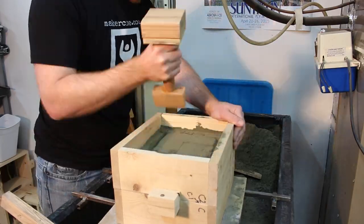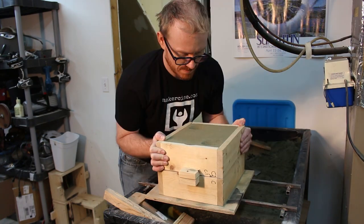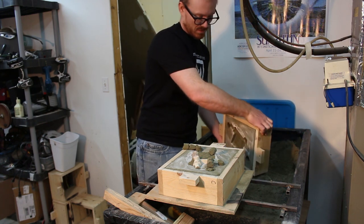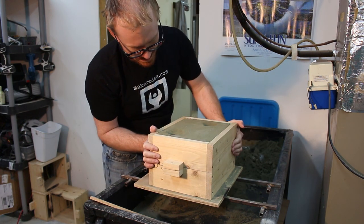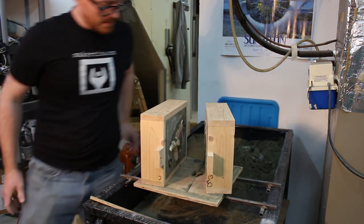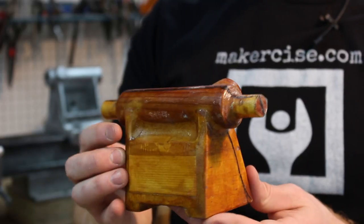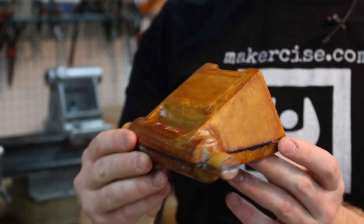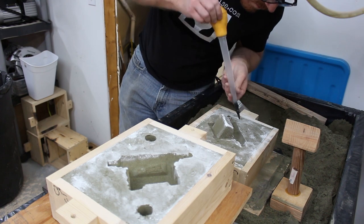The cavity on the front of the tailstock made this pattern fairly difficult to mold, and I ended up attempting to make the mold several times. The first attempt failed because I forgot to do the second roll and pulled the drag off the top instead of the cope. The second attempt just wouldn't separate very easily, so I tried to flip it on its side, which still didn't work. Then I went back to the drawing board — I redefined my parting line, put on some shellac to make the pattern a little bit slicker, then sanded it and overall improved the pattern. That was the trick I needed to successfully make the second roll and remove the pattern from the mold.